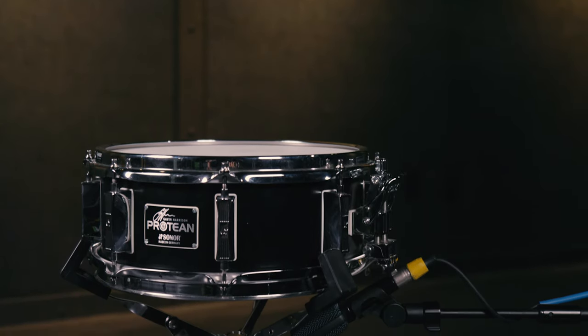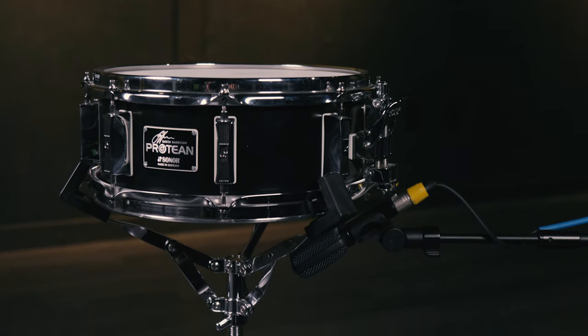This makes the mic quite versatile. While it's ideal for guitar amps, give it a try on other sources as well. Try it on bass guitar cabinets — it's great on drums of all types and even percussion instruments. With its flat physical design, you can get the E906 in tight on snare, toms, and even kick drum, and the low profile means it won't get in the way of the drummer. Because of the high frequency response up to 18 kilohertz, the E906 makes a great choice to place under a snare drum as well — it will cleanly pick up the rattle and snap of the drum snares.